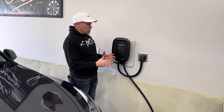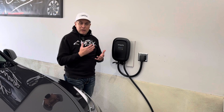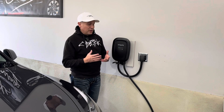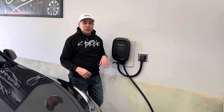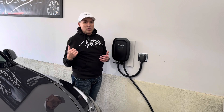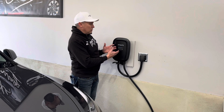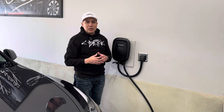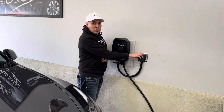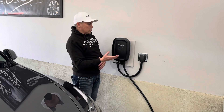Overall, I'm impressed with this charger. I like the features, I like this plug holder right here — I really like that feature. The app is very easy to use and intuitive — it's a great monitoring option. You've got Wi-Fi so you've got instant updates. The cord length is very nice — 24 feet from right here all the way to the back of the car, so I don't have to get an extension cord out. You don't have to have the plug right next to the car. It's also really easy to install. The big thing is having the plug already installed in my garage. So if you're looking at an EV and looking at charging options, get the NEMA 14-50 plug installed in your garage with the 50 amp breaker — that's going to make a lot of possibilities with EV chargers like the Emporia one here. You can just plug right into it and all you have to do is mount it.